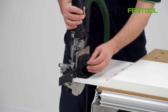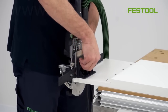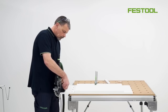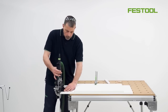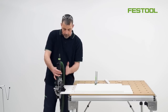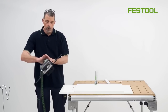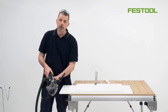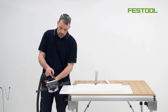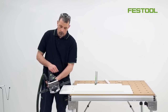The additional stop gives me a bigger surface area to work with, but also a lot more stability. While I'm working, I've got a machine which is stable to use and will also be kept at 90 degrees to the work. The important thing to remember is that we can now easily adjust the depth of cut for the domino to 15 millimeters for this cut. Take the width setting back to the first position so it's tight, and then we can open this up as we work our way along.